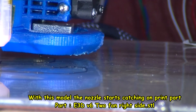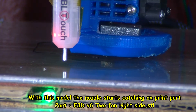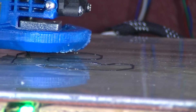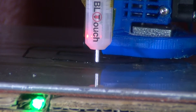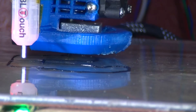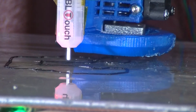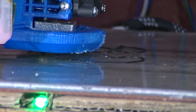I'm going to try again here. That looks pretty good, I would say. I'm not scared there. So what have I changed? I've tightened up the nozzle. I thought that nozzle had been tightened but presumably not tight enough. That looks absolutely really good. I was going to say absolutely brilliant there on that skirt.